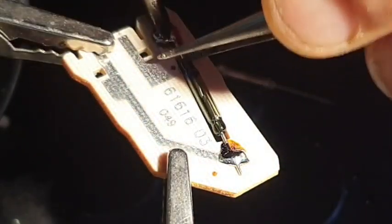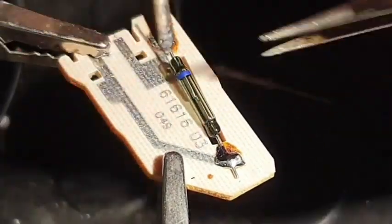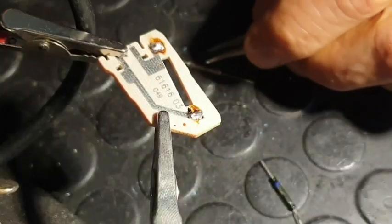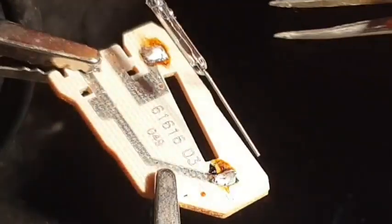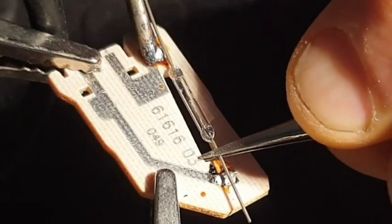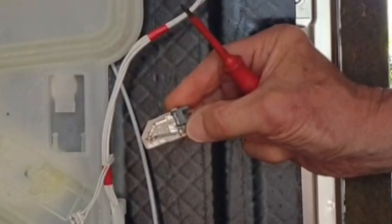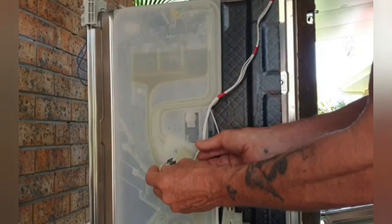These contacts are easily replaced and require only a basic soldering iron and some basic soldering skills. When replacing the contacts, remember the orientation and be careful with the wire ends, as they can easily break the tiny glass tube when bent without support. After cleaning up the flux residue with IPA, I connect the wires and place the contact back in its pocket, ready for a test.